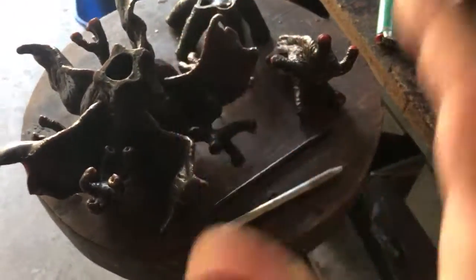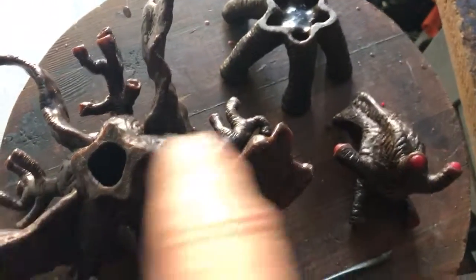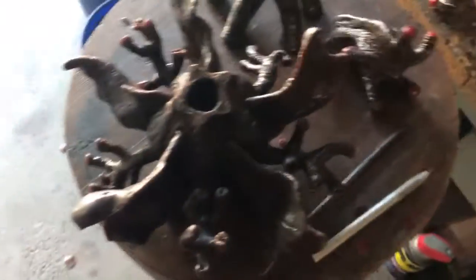So, here's what's going on with the Elder Thing. My teacher was telling me that this is going to be a troubled piece. There's a lot of potential for shrinkage, which is where the metal kind of freezes and does what it wants to do rather than follow the shape of the piece. Looks cool, but not what you want in a casting.